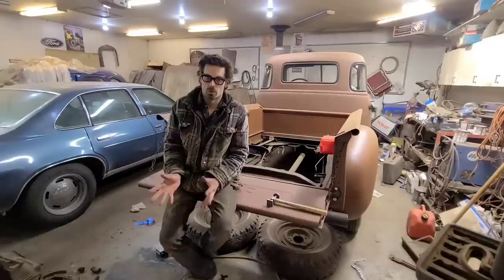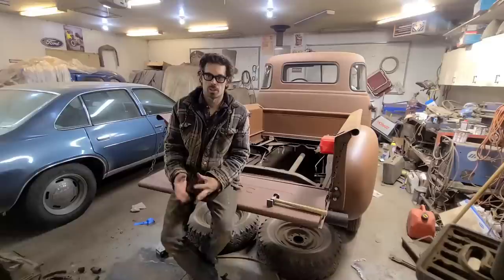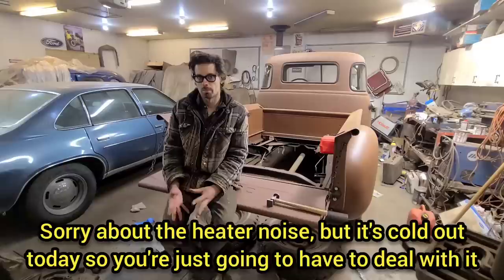Problem with that is it is very invasive. You're heating that metal up to the point where it's red, and obviously that is completely changing the grain structure of that metal. And a lot of times when the panel gets stretched during damage, the actual stretch isn't as significant as one might think.